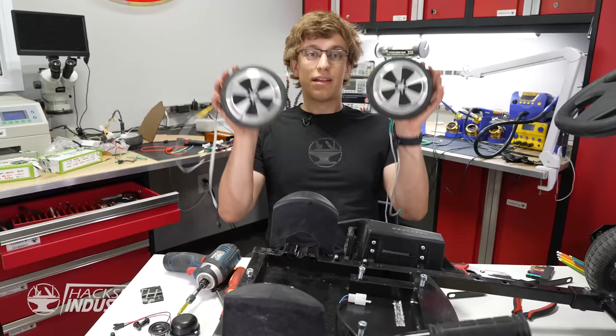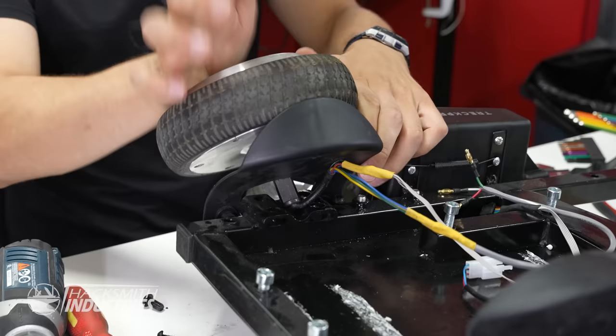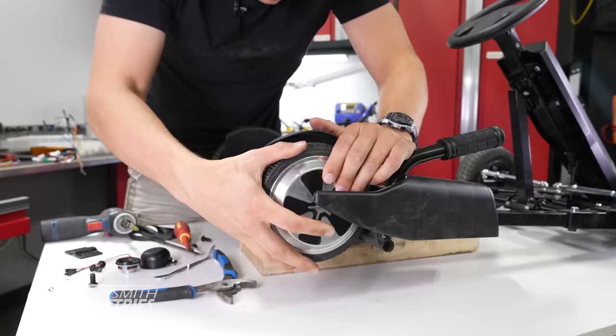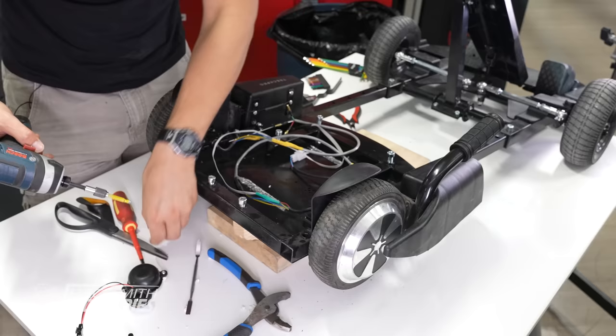These are our new motors. We need to install them in the spot where the old motor and the old rear wheel were. These are 350-watt motors. Our old motors were 250 watts. We're also adding a second one, so that's a total of about 1 horsepower, considering we're going to be running these things a lot harder than they're really designed for.